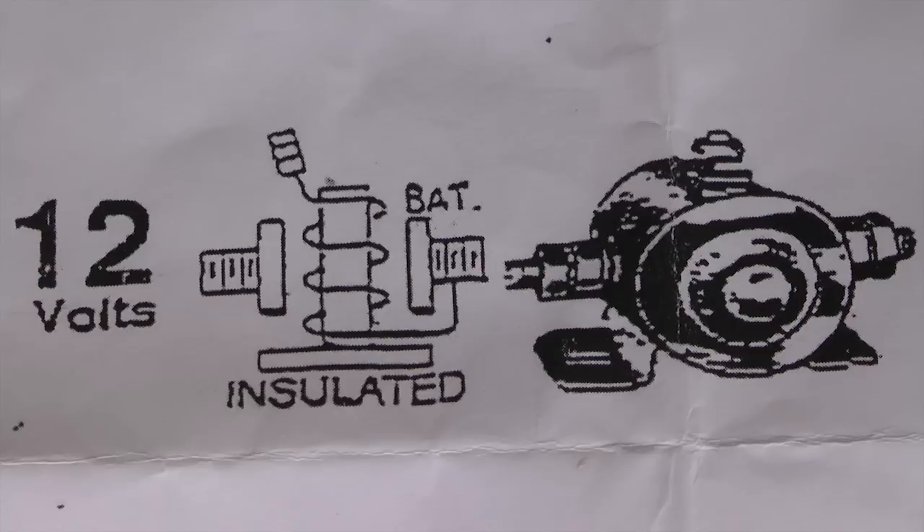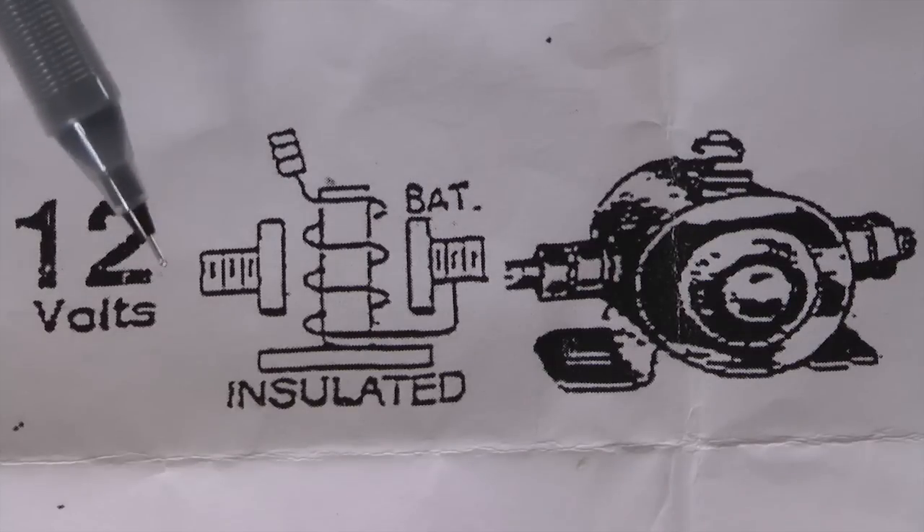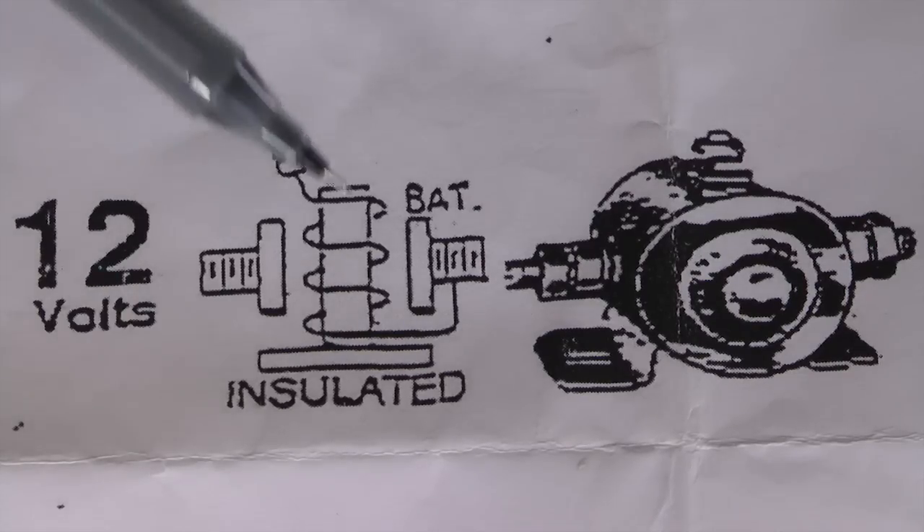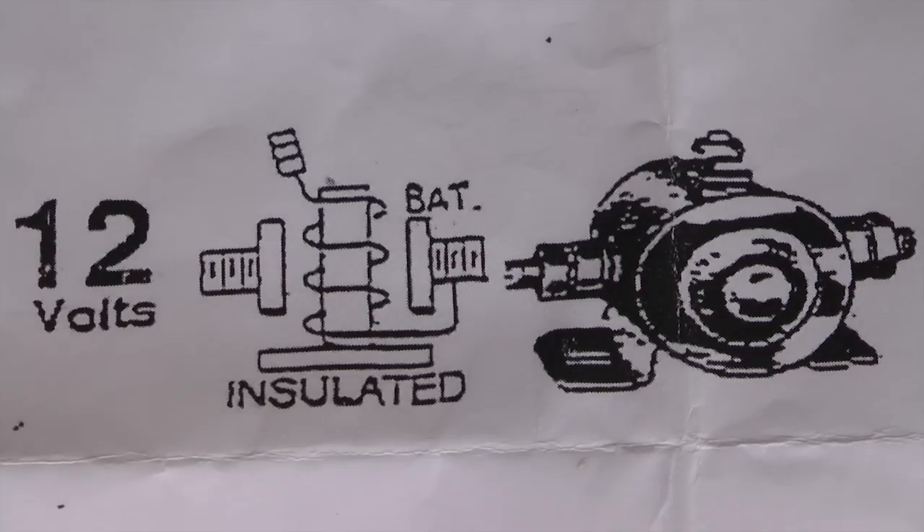This makes it very simple. The purpose of this battery contactor is to provide a switch which connects the large post to the large post, energizing your aircraft's electrical bus system when the coil is energized. This coil draws about 1 amp of current and can be left on continuously.